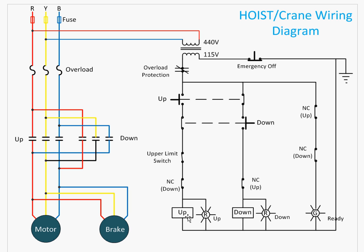So the interlocking mechanism works as follows: when up operates, down cannot operate, and when down is operating, up cannot work. Additionally, using the push buttons, when neither contactor is operated, the green light stays on, indicating the crane is ready to operate. When the operator presses up, that green light goes off and the red light shows the crane is going up. Similarly, when the down button is pressed, the ready light goes off and the other light indicates the crane is going down or lowering the load.